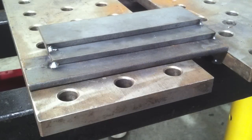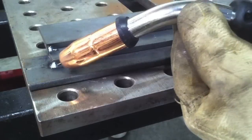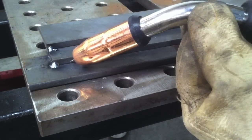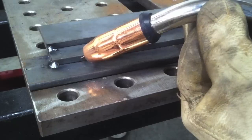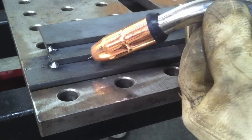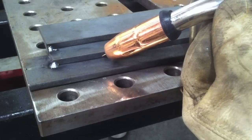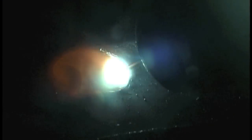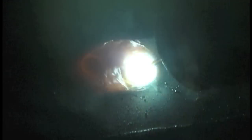I'm using hot rolled A36 steel, quarter inch, and I didn't clean a thing because I wanted to also see how well the arc penetrates through the hot rolled mill scale. That's important to know, and also I just didn't want to spend the time cleaning it. Realistically, if you're fabricating a trailer, a set of shelves, or a rack, a lot of times you would not clean that hot rolled off.